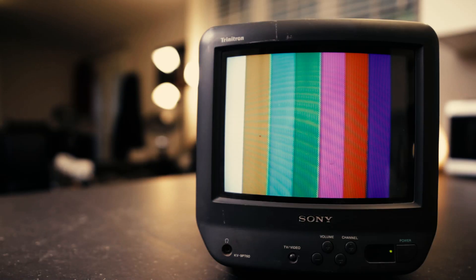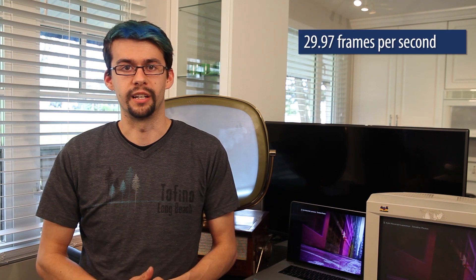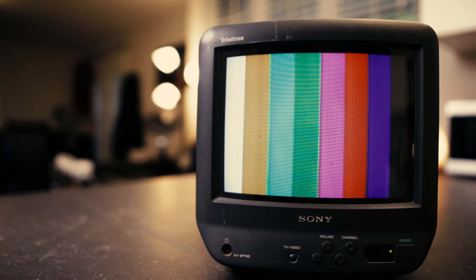When trying to film a CRT television or monitor, you will experience a crazy flicker or rolling bar. This issue doesn't happen with LCD displays. However, the old CRT monitors and tube TVs — even though they look normal to my eye — are not looking good on camera. They flicker. The reason for this is because they're out of sync with the camera. The camera is shooting at 24 frames per second or 23.976 frames per second, while TVs and monitors are projecting images at 30 frames per second. This is also caused by the way that a cathode ray tube television is designed and how the camera perceives the phosphored dots in a different way than our eyes.